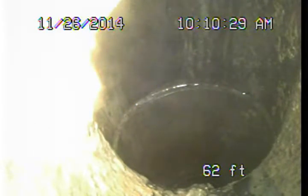Alright, so we got the toilet off and did all the investigation we needed to. It looks like they omitted the main sewer line clean out for this branch. So I'll mark it out and recommend one being installed. Pipes are only about 18 inches deep, so it's a pretty simple thing to do.